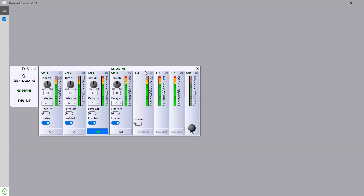If you look at the mixes, you can see this is where you would enable or disable the mixes for monitoring, and they would join into the flip-flopping. You can also go to the output tab, where as well as being able to adjust the gain of the loudspeaker remotely, you can set a minimum level — so if you want to stop the user from turning it down completely so they can always hear something, you can set the minimum level there. You can set a maximum level to limit the maximum volume of the speaker, and for any low material coming in you can set an overall volume boost for all of the inputs.